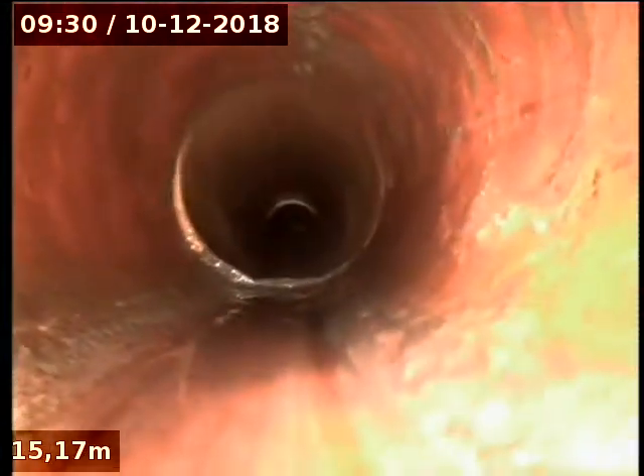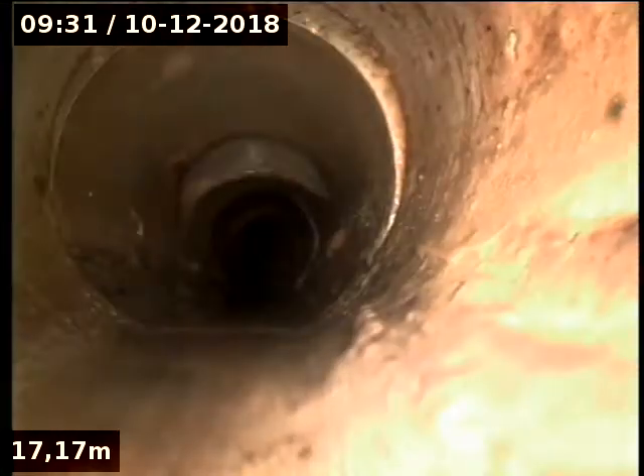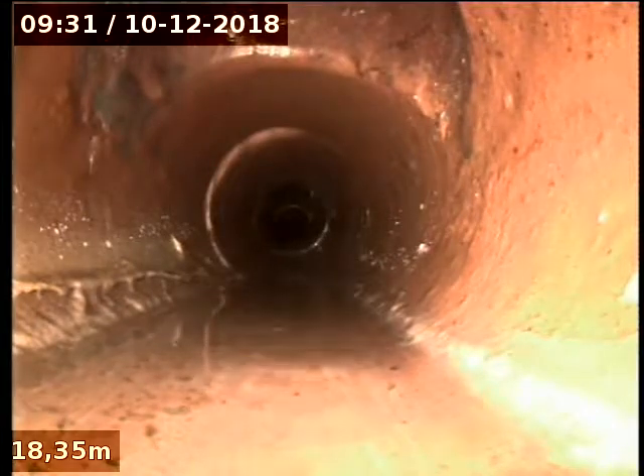Inspection opening, more joins. Crack in just about every piece of pipe on the way. I think we're past most of the junctions — now we're going through to the backpackers. Bit of a belly in the drain there, holding a bit of water. Another junction — what are we, 17 metres? That counter is only from the reel, so you've got to take off a few metres. That's probably about 15 metres up there roughly.